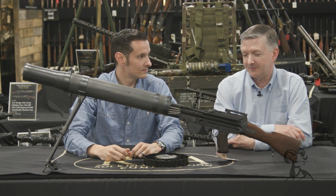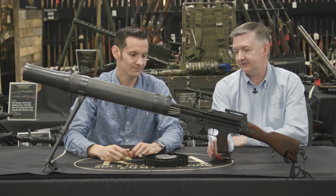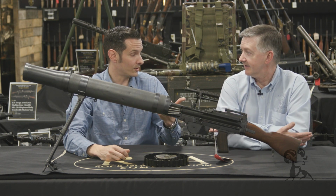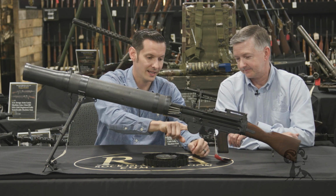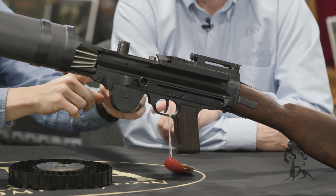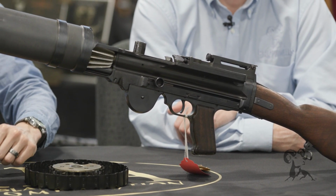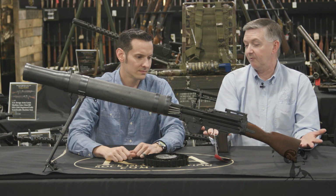Yeah, they're super amazing guns. I mean, the mechanics that went into this and the radial cooling fins, that was way ahead of its time. And the recoil system, there's a sprocket type system at the bottom here, and this piece at the bottom has a spring that's wound in it. And as it recoils, it winds that spring, and that's what sends it back forward. So really genius. And it's just amazing that it was done when it was.